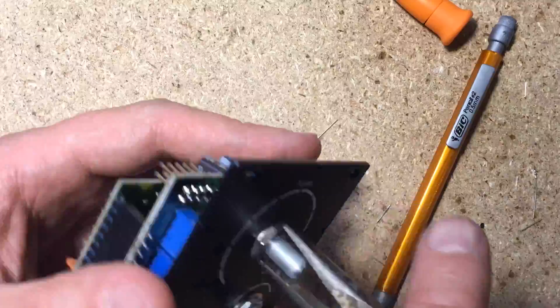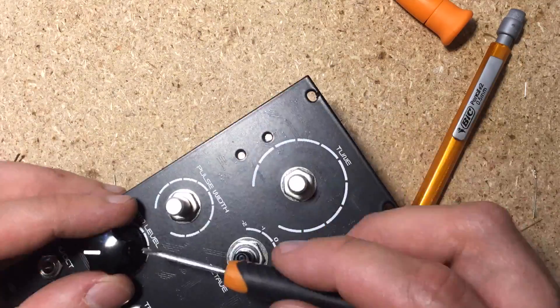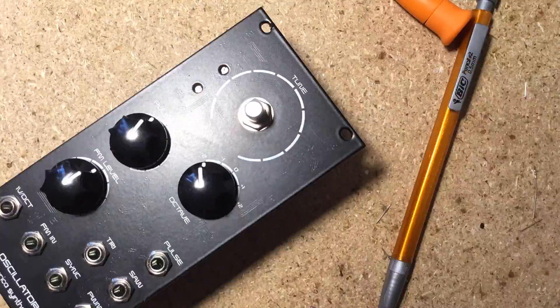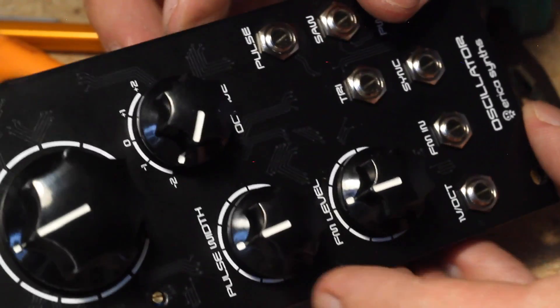Finally place the panel back on, tighten all the nuts and place and tighten the control knobs. Check the power pins for shorts using your multimeter. There are also multiple checkpoints on the board — this is step 7 in the user manual. If everything checks out, go ahead and plug it in. Once it's plugged in, check to see if you're getting sound out of the three outputs and if it reacts to the octave switch, the pitch knob and the CV inputs. Calibration is fairly straightforward; the trim pots are conveniently available right from the front panel. The top one is the scale adjustment and the bottom one is for the octaves. Just follow the detailed instructions in the user manual and you should have no problem getting it to track very well across many octaves. Fine tuning with the tune knob can be a bit fiddly because it covers a lot of range, making small adjustments difficult. But this is so you have a lot of range available right on the knob, which is great for playing experimentally without an external controller.